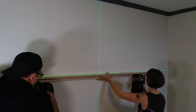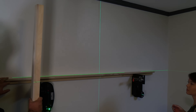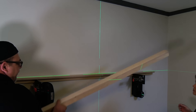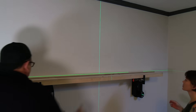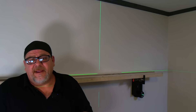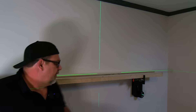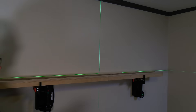Maggie and I are going to go ahead and set this up to our laser line, then install the front piece. With the back piece installed and leveled with our laser line, we'll just bring our front piece over and drop it right in. Now we can set cabinets up there. No walls are perfectly straight, so if you need to move the cabinet back or forth, you can take a small shim and put it right underneath a piece of the material to move it whichever direction you want.